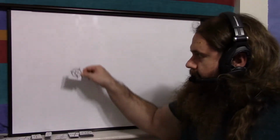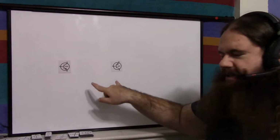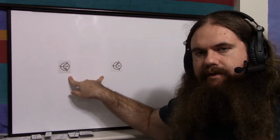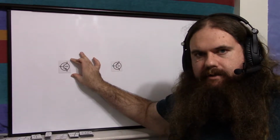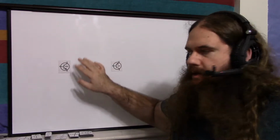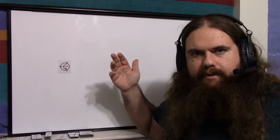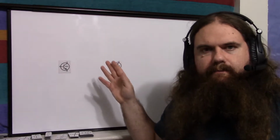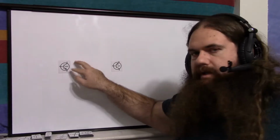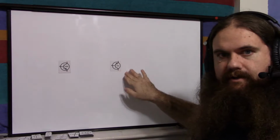So let me quickly show you what I'm going to do and then I'll do it. A standard NPN and PNP BJT transistors, which is redundant. The T stands for transistor. But anyway, recall that if you only connect two pins, if you connect across collector to emitter and don't do anything with the base, then it's going to just block the current. There'll be a tiny bit of leakage, maybe in the picoamps, but basically nothing will happen. Unless, of course, you apply 100 volts and blow the thing up. We're talking normally. Normally, if there's nothing on the base at all and you connect across collector to emitter, nothing happens. Same for the PNP.